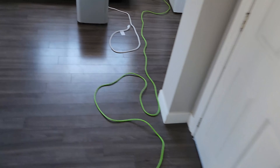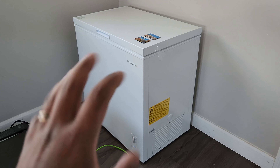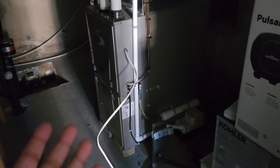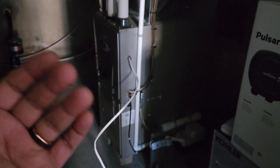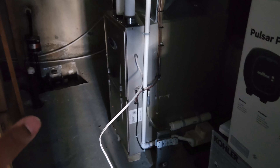The wires come from the garage all the way downstairs. One line is plugged into my freezer — I don't want the food to go to waste, and we have milk for the eight-month-old baby, so keeping food fresh is really important. I also have a gas furnace here — it doesn't take much electricity, just needs the fan to run and the electronic components for the thermostat. I plugged an extension directly into the furnace's electrical connection — a temporary fix, but it's been heating the whole night. A gas furnace barely takes 200 watts, so I can run on V2L for days just on heating.